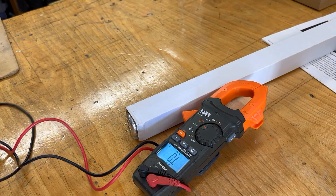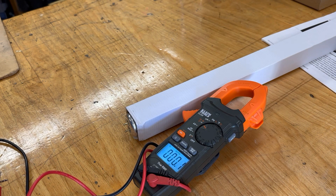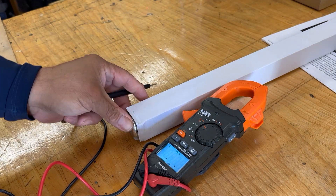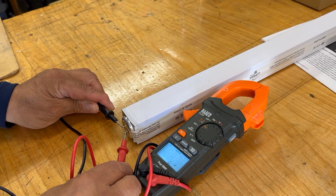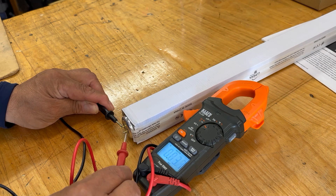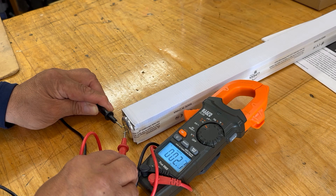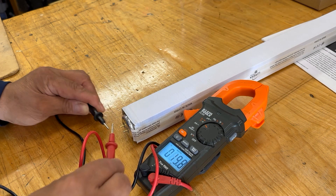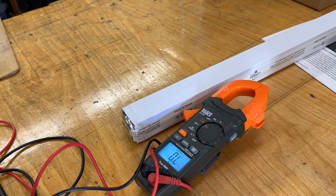I'm getting 0.5, 0.1 — 0.2. I should have two ohms or approximate here. When I check this it should be on the leads right there, and it'll bounce around so you gotta let it go down. 2.1, 2.0 — that bulb is perfect. But you can see how moving the leads around you can get a false reading, so you've got to keep it very steady. Good to go.